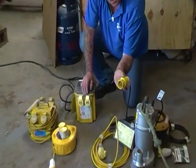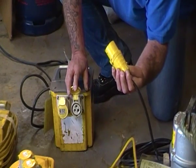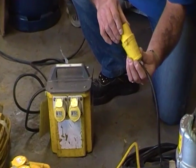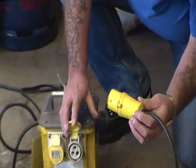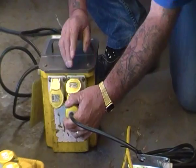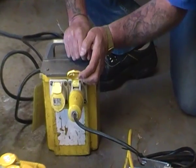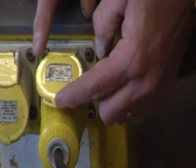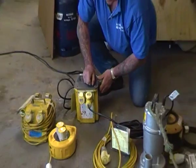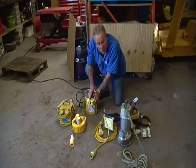This is the plug that would simply plug into the transformer, and you can see how this will only go in one way because there's a little raised bit — a nodule — on the bottom that simply guides into the slot on the transformer, and then you push that home. The safety features go beyond that because the lid of the female part of the socket clips down over the male part where there's a little upstand, and stops that plug being pulled out accidentally. So there are a lot more safety features built into 110 volt equipment than there are with 240 most of the time.